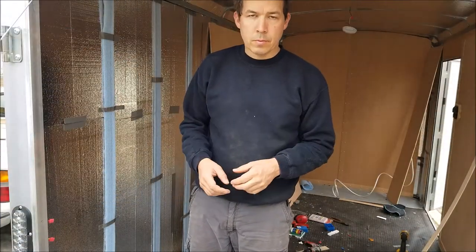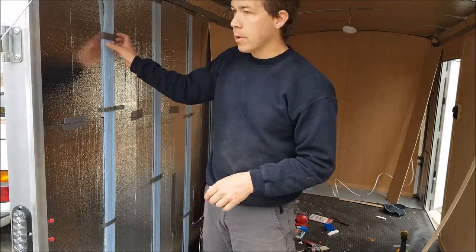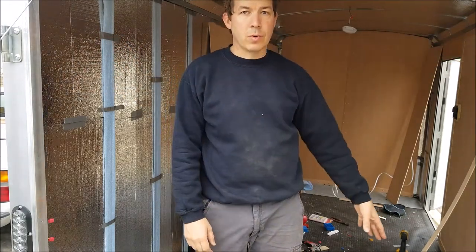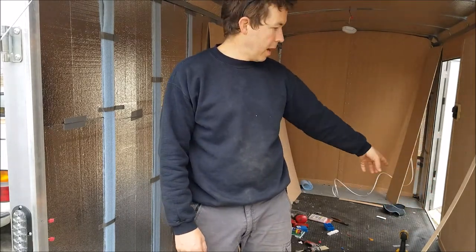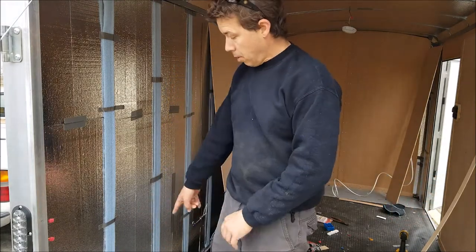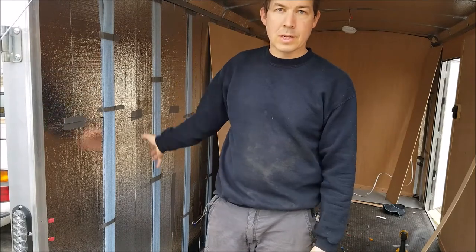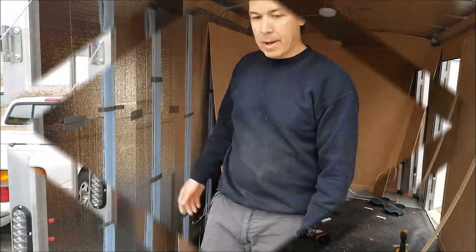Here's a quick tip: if you're going to build one of these, before you put the siding on, mark where the beams are — mark the outside edges of them — so that if you're going to screw down to them you can find them. I only did it on the top on this side and forgot to do it on the bottom. It was really a pain to get those lined up. Mark the center points or the edges of your beams so you'll know where to put your screws through your paneling once it's on, because you can't see them. I used a magnet to help find them, but it was still a close thing.